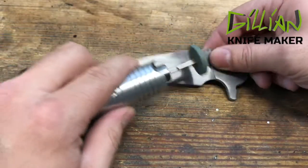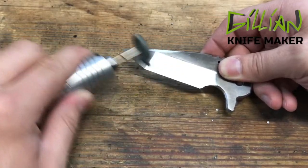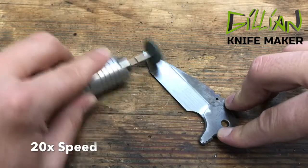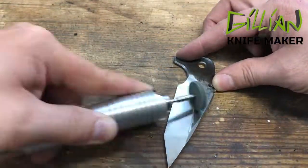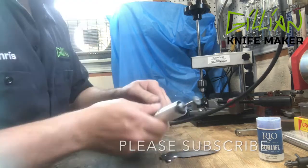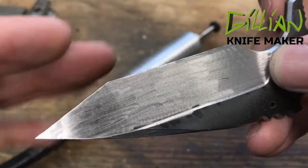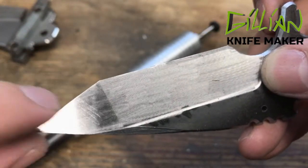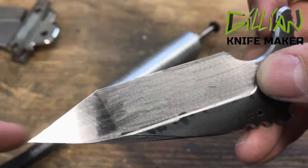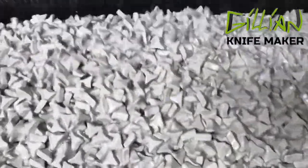Okay, here we go. What I've done is gone from the coarse grit up to the medium, and I'm going to work my way through all four grits of the Kratex, constantly sanding out the step-overs. This process is going to take me a few hours — probably honestly all day. I'm going to give these blades a quick tumble; we've just finished sanding them out. The next step — I'll meet you at the surface grinder where we'll take the blades down to the final thickness. I'll see you guys in the very next video.